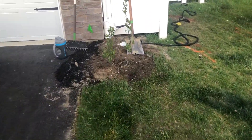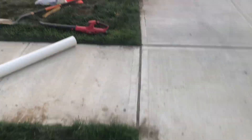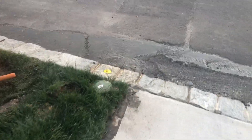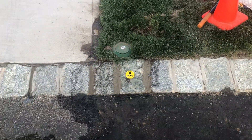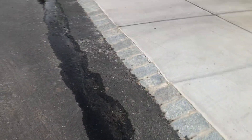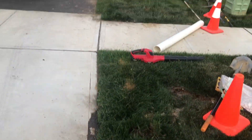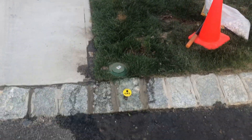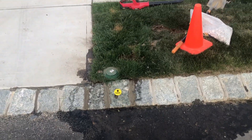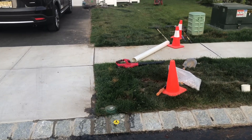This is how you show how your system works: after everything's done, put the hose in the cleanout and the water will come all the way to the end. Water pops up, builds up, and facilitates down — it'll go all the way to the nearest storm drain down the street. That is exactly how you prevent your yard from flooding by running out your downspouts. Another job well done by Jersey Shore Drainage Solutions — as always, like, share, and subscribe, and until the next one.